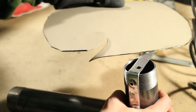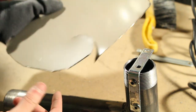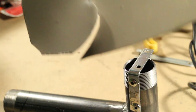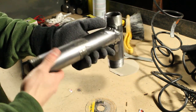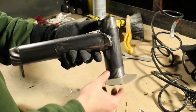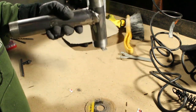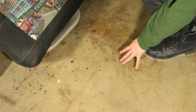This is about the simplest thing I can think of to make a little removable cap — I'm just using some tin snips to cut out a little circle from the chunk I cut out of the chair. Take your little piece, jam it in there, and that will make sure all the air blowing in from the hairdryer goes straight out of the top into the pan with all the hot coals and not out of the bottom. When this part fills up with coal crumbs and ash you just pop it out, give it a few taps, and stick it back in. This thing can really store anywhere a regular folding chair can.